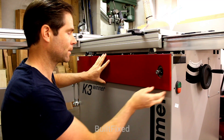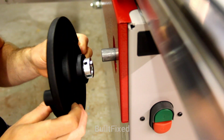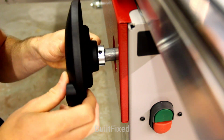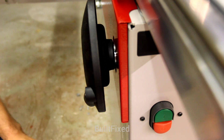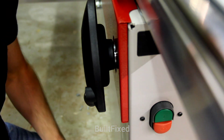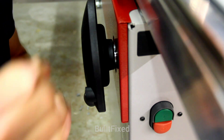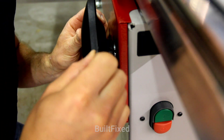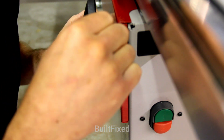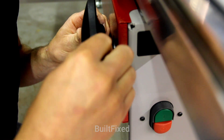Now the bottom is locked in. Take your system hand wheel, align this slot with the pin, and press it in all the way. With your 3mm Allen wrench, tighten that set screw on the shaft. This is where you encounter a problem — a standard Allen wrench cannot get in there. An Allen wrench with a rounded end might work, but with a standard Allen wrench you'll strip the end off.